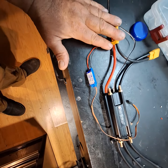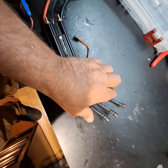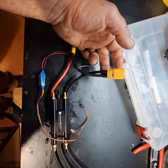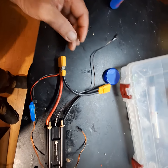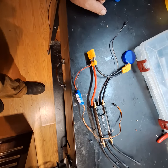So we should be able to run this BEC on half the voltage. We've got the 10-millimeter bullet soldered on, plus the XT90 anti-spark on the other side for the batteries, so you can run 12S in the big Apache.